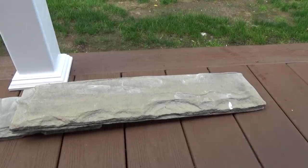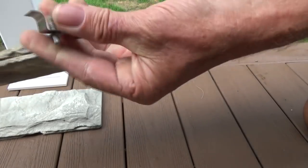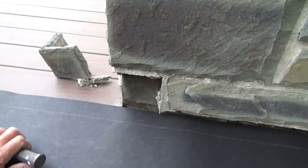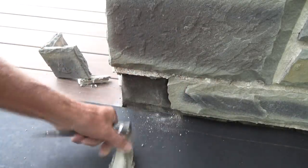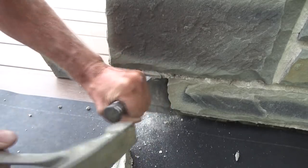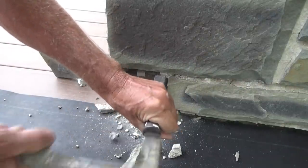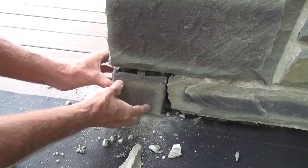This is nothing but a piece of flagstone that's all it is — they cut it square, and these are clips that would clip it into the side of the building and then they pack it with cement. I'm going to reproduce this at the end of the video. Let's look at how they put this cement on. Nothing holding that cement — got to get it out of our way. Right there, there's one of those clips. Cement is no big deal and this will go back up in there.